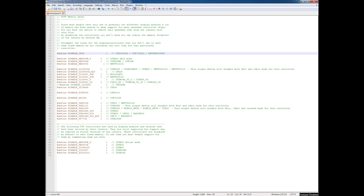The documentation says you can save space by disabling the displays you aren't using. On Windows, go into Documents > Arduino > libraries > UTFT folder and find the memorysaver.h file. Uncomment all the disabled statements that aren't your display — the only display we really need to keep is the ILI9481. For all the other ones, remove the two slashes to disable them. Save the file and then you can upload.